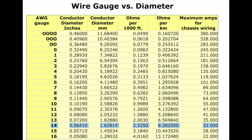If you have a car and the maximum it can go is 120 miles an hour, you wouldn't want to drive at 120 miles an hour all the time, because you're going to burn out the car. Same goes for breakers — if you're at half or a little more, that's good. You don't want to be at the maximum allowable current for the circuit.